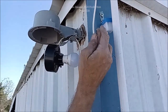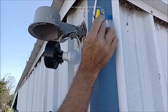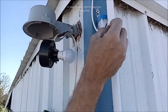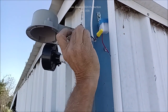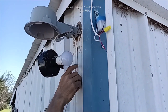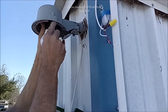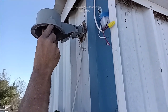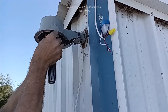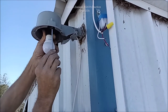Here's my power wire — this is my negative, this is my positive. My positive is going to the black wire, and then this wire will go to the light, and this wire will go here and also to the negative on the light. So both — this white wire feeds both. I've got my wire fed through here and I'm going to install this nice little gutted box right back up in here. Then we're going to wire that up and show you.